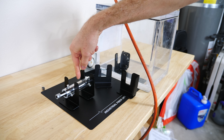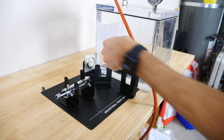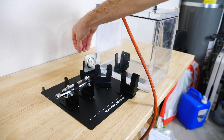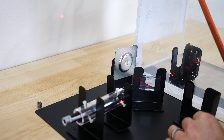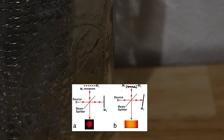So what I have here is my laser light, a beam splitter right here — just a piece of glass — a mirror right here, and a mirror in my vacuum chamber. The beams are going to combine into one and go through this lens, which is just there to spread out the beam of light to make it bigger so it's not a tiny little dot. When I turn it on, you can see two dots of light, but they're not stacked up together — I need to adjust my mirrors a little bit. Once you get them right on top of each other, you can see the interference pattern. You'll notice I'm not seeing a full circle like in some interferometer experiments — that's because my mirrors are slightly askew, so you only see a linear version, not a circular version, but it still works just fine.